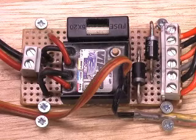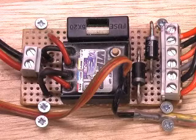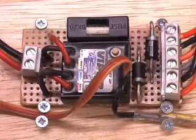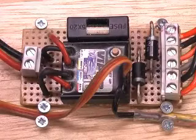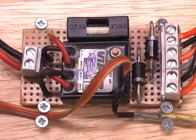The Viper 10 speed controller sits on a circuit board. The motor has a 5 amp fuse. Two diodes allow the current to reverse through the end stop microswitches. To interface with the circuit board, PCB terminal blocks are used. Later on, these could be replaced by wiring the motor and the switches directly onto the circuit board, reducing some cost.